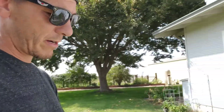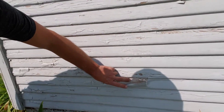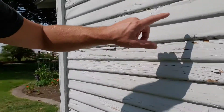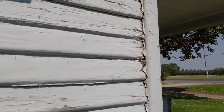Let me show you the kind of damage we're dealing with on the south side of the home. This house has got to be dang near a hundred years old, and I know for a fact that underneath here is going to be an oil-based paint, because that's what they used when they built back then. That oil base is part of why you're getting this buckling. Also, with this type of old siding — shiplap-type siding — you don't want to caulk it in, because it traps moisture behind it, and that's what creates this issue where the paint is just buckling out.